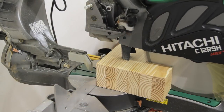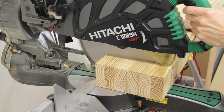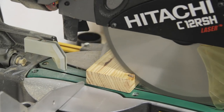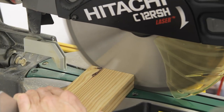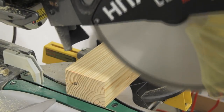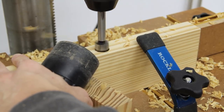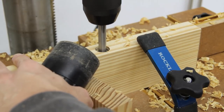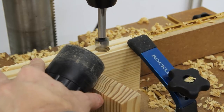To finish up the top I started by cutting the left end of each laminated section at the miter saw. I then cut the boards that contained the leg mortises into three pieces, and to make sure that the matching front and back pieces were identical I made one final pass trimming each pair together. Before gluing these into place I went ahead and drilled three-quarter inch dog holes as deep as I could with my Forstner bit so that it would be easier to finish making straight holes later with a spade bit.